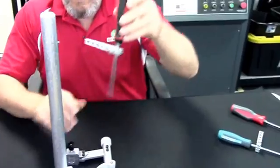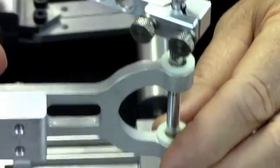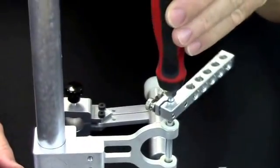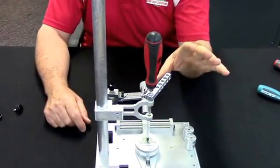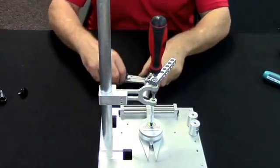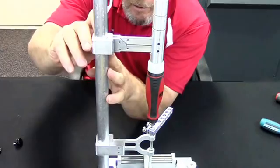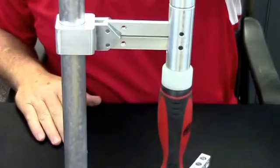Start off first with our first competitor screwdriver. I'm going to raise this yoke just to the point where we can get as close to the handle as possible. I want this turning force of this handle to be supported by this yoke as best I can. That way I'm providing twists that will be transferred down to the screw. I'm going to put this weight on top of the handle. Again, this is a nylon bearing — it has no resistance on it. As long as these arms are parallel, we ensure ourselves that the weight is actually pushing straight down on the driver.